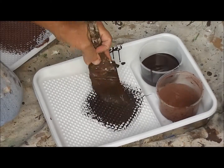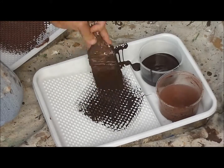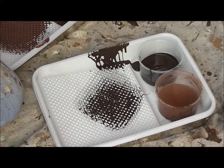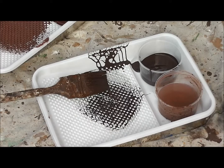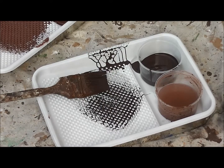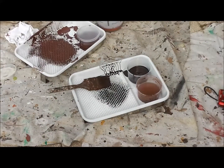The darker color is going to be thinner than the fiery brown. Because it's thinner, you want to have even less on your brush, otherwise it's going to sag on the door. You can take a dry rag and just hit the end of the brush on the dry rag before you put it on the door, otherwise the paint's going to sag.